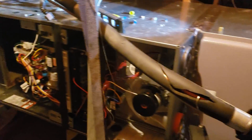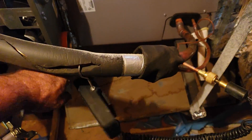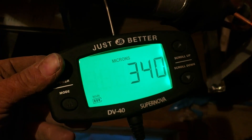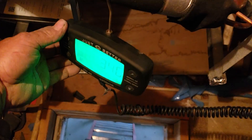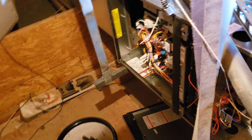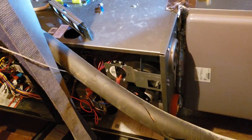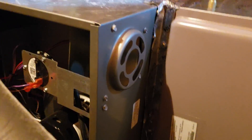I'm putting in basically a Rheem unit — Thermal Zone — up in this attic. Check this out: I have my micron gauge inside with the vacuum pump outside. 340 microns and it's running right now. I think those welds are good. The other thing I did was flush these lines with RX11, which most people don't do when they upgrade from R-22 to R-410A on this unit.